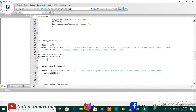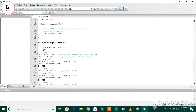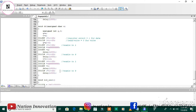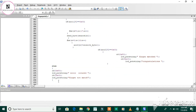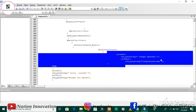Otherwise it shows 'error occurred' or 'character file not built'. These are the simple functions for UART sending bytes and receiving bytes. This is the delay function, the command function, and the display function for the LCD screen. This is the LCD initialization function. So this is all about the code — when the fingerprint is matched it will display 'fingerprint is matched' and 'congratulations'.